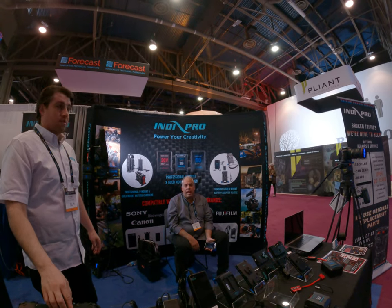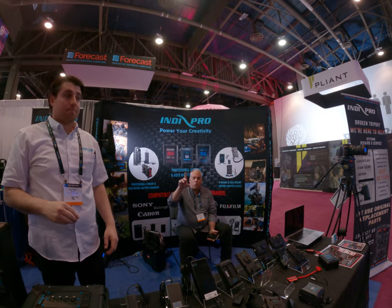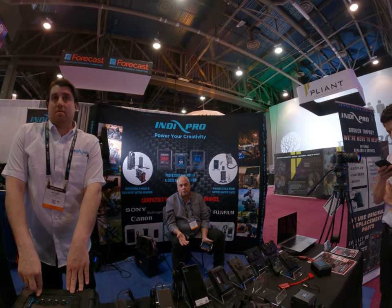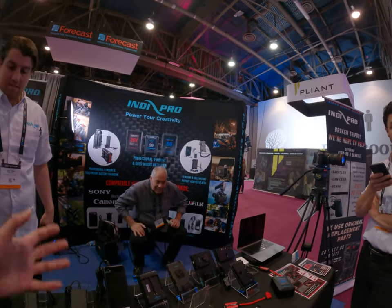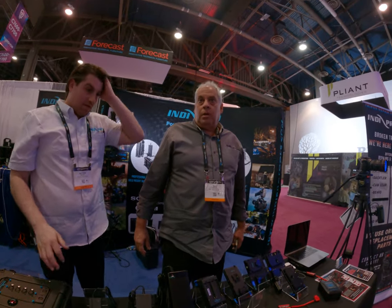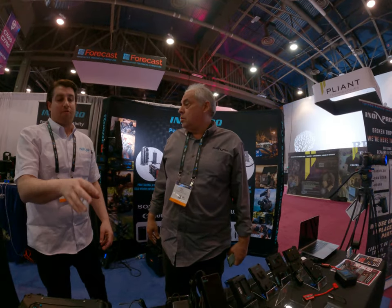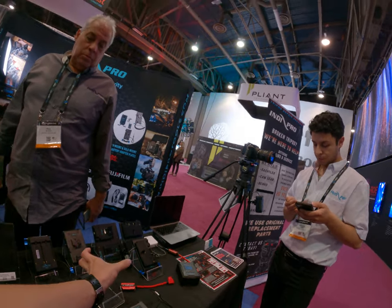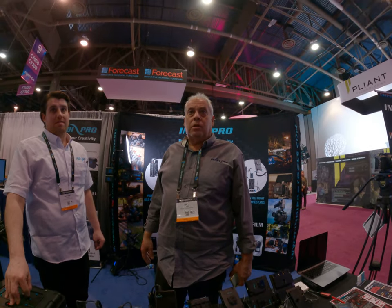If you need any upconverters — what kind of connector is it going to? An XLR? What are you powering? A light. So, like an XLR, 4-pin connector. You want to take a regular V-mount battery and pump it up to 26 volts to power a higher voltage light. Actually, if the light already has a V-mount plate on it and it requires 26 volts — just get a 26-volt battery. You can do that right there. We have these options as well — special batteries for lighting.